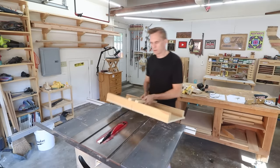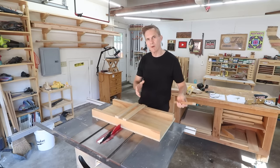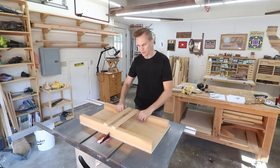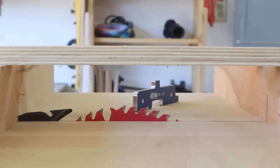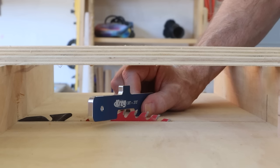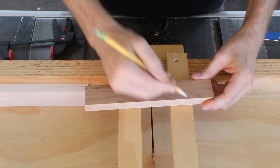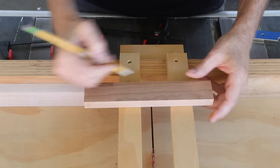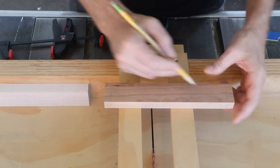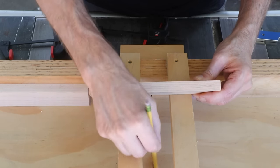I'm going to use my crosscut sled to cut out the middle parts of that spine. The reason why I want to use this instead of my miter gauge is that I can control this small piece of wood on both sides of the cut. I want to set my blade at 3/8 of an inch high — I'm going to use one of these little setup blocks. Basically what I want to do here is cut out a big dado in the center section of this spine. It's going to start 3/8 of an inch over on each end, and then this whole center area will get cut out to that 3/8 inch depth.